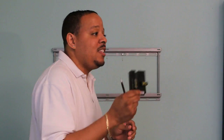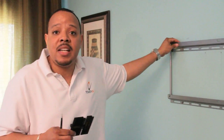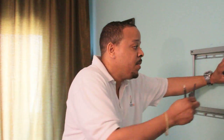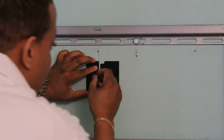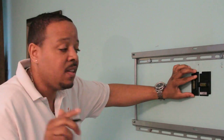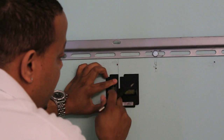The first thing you wanna do is get an easy cut. You can purchase one of these at any local hardware store. And this will allow you to make the templates for the holes that you need to cut. If the mount is already up, 9 times out of 10 it's gonna be mounted into the stud. So this area right here is gonna be open. So you wanna pick this area. Make sure that you have a perfect level. And then we're gonna make two single gang box cuts.